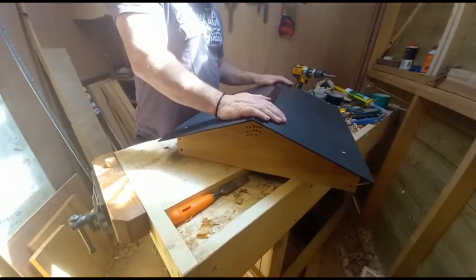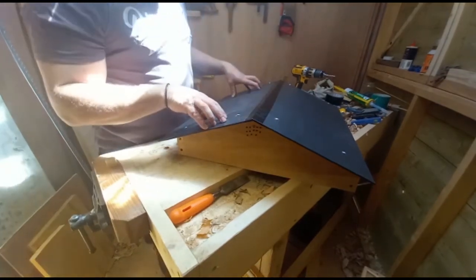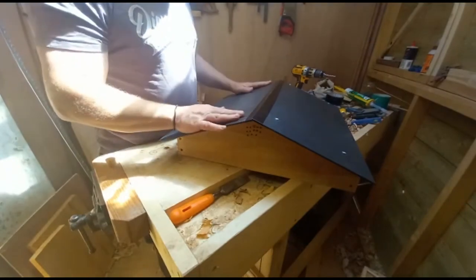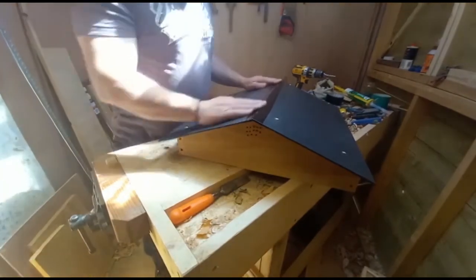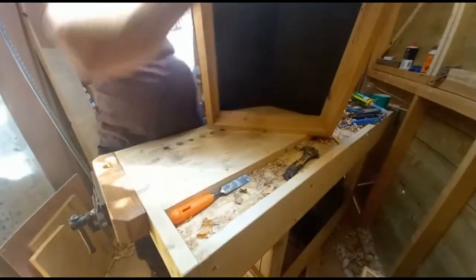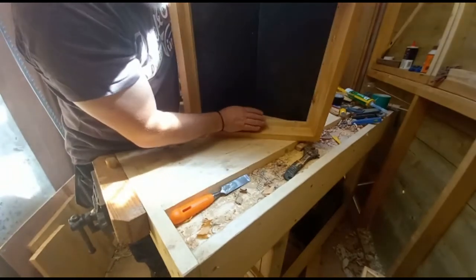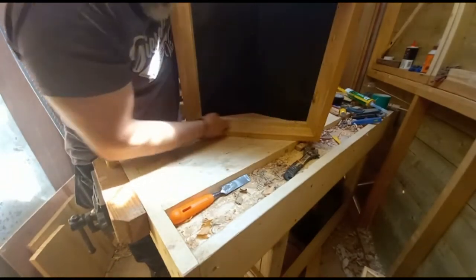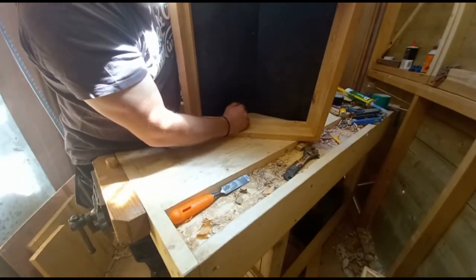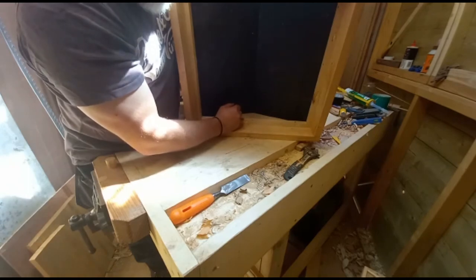So that's the roof finished. The slate, I just screwed it down with some cup screws. They're flat on the bottom, so they sit nice and tight down. Put a bit of sealer on them. Put a bit of sealer along the centre, and then put a bit of weather tape on top of it. Inside of it, it's like this. This is where it sits, so it sits nice and snug. This creates a seal around the top of the hive, but there's room in here to sit a 2 liter feeder for feeding the guys in the winter months.